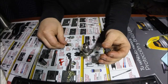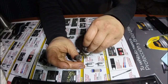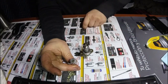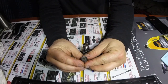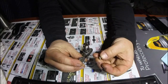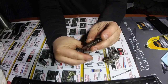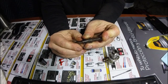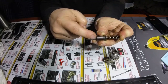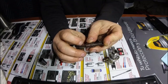So this is a stop plate. This actually goes over that — you can see it just covers up the tip of the needle there. We'll go ahead and put this together in reverse. Put those pins in there. You can see that doesn't really move up very far — it actually stops. Then we have a spring seat, which sits right there, and we have a spring. You have this very strong spring — I can barely push it down with my fingers holding the body.